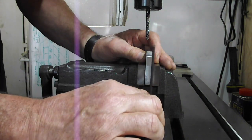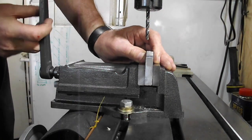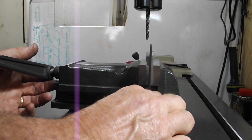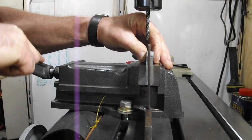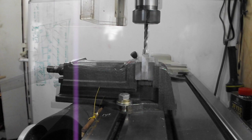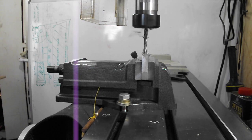After cleaning down the milling table I clamped the milling vice and set the workpiece fairly true using a set square. Here's where I cheated a little bit: instead of drilling all the way through I drilled halfway, then turned the workpiece over and after setting it up again drilled the other side and then through. Drills that are not very well ground will wander a bit, so I couldn't risk that — so I fettled it out a little too.